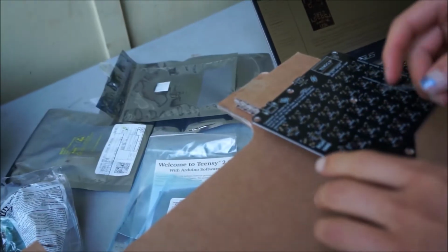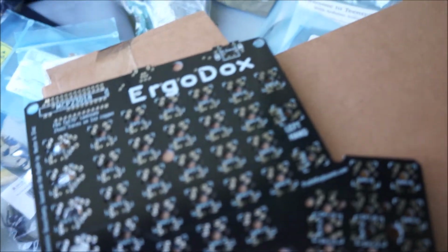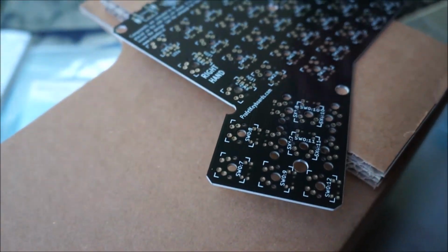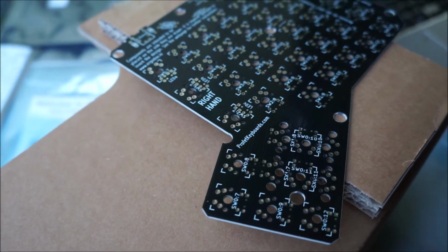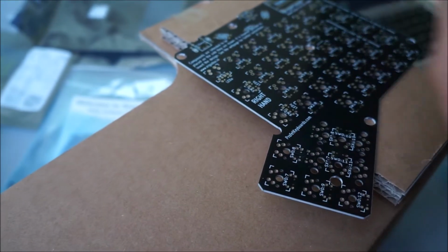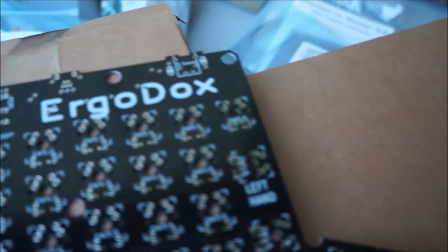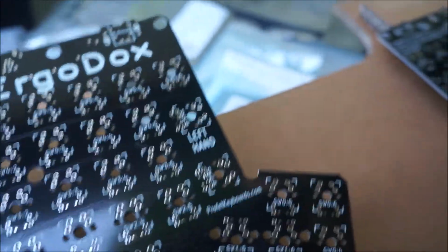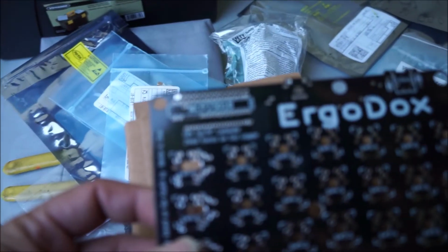So you do it from the top? Yeah, and then the wires will stick out the other side. Immediately left and right of the copper pads. You think right there, right? I don't know. Yeah. Check the orientation. Make sure that the cathode, negative side of the diode, is closest to the square hole.